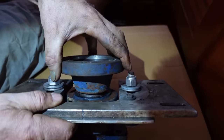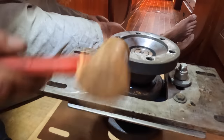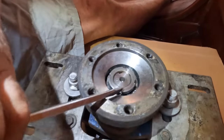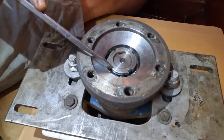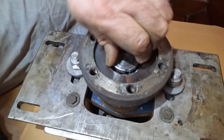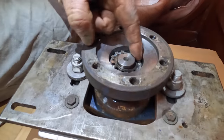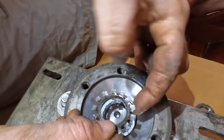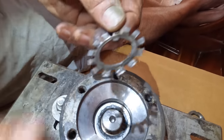There's a lot of movement all through this. It's rattly, so we're going to pull it apart and see what we've got. I don't actually have the tool for this but I'll just gently tap it. This has been tapped before, so whoever's played with this before me has done the same. I'd actually like to get a new nut if I can, and the proper tool to put this back together. The chamfer on this is set down. This keyway — if I can get a new one I will. This washer has got a little cut in it; you follow that and once you've got your nut done up you just fold these tabs up. I can potentially reuse that but I'd like to get a new one.